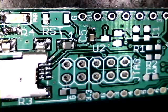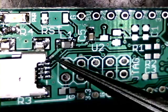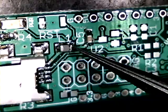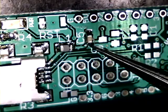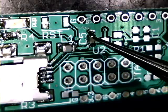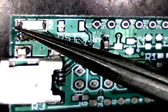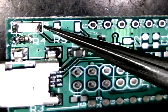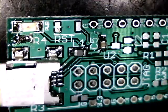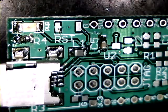So why did we do this — why these components? We should have 5 volts from USB going to this filtering ferrite bead, which blocks high frequency components, and then another capacitor which stabilizes the 5 volts again. Then we have traces going over to the LED, then from the LED to the resistor, which is the series resistor of the LED limiting the current through it, and then to ground. So with these few components, if we did everything right, we should have the LED come on when we plug this into a computer. Let's see.